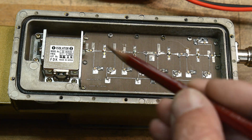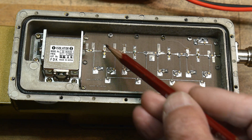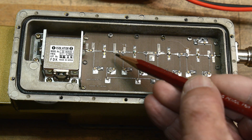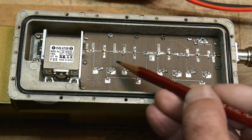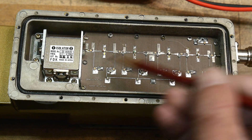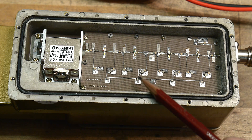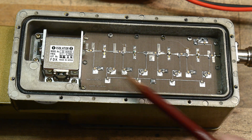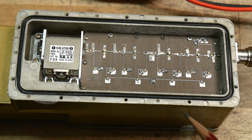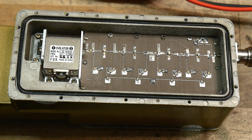There are little matching stubs, and you can see these thin traces that feed the bias point in — that's an inductor that keeps the DC out of the AC signal path. All four bias voltages come in down here and they bias the four transistors. Each one has matching stubs to maintain 50 ohms throughout, and then the signal finally comes out the connector.